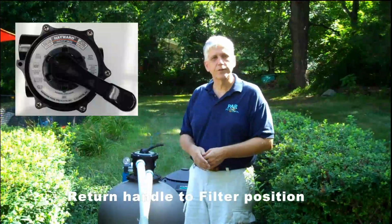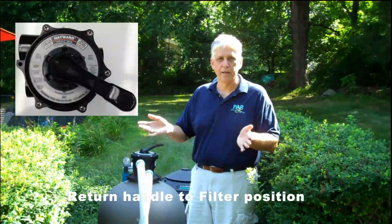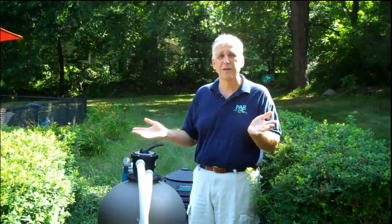Again, turn the pump off and go back to filter. Back on filter, turn the pump back on, and you're all set to roll. That's it. That's all the magic that there is to backwashing a filter.